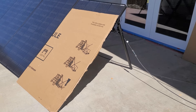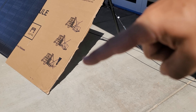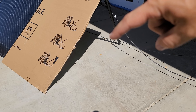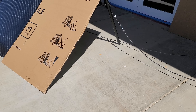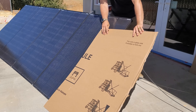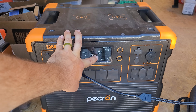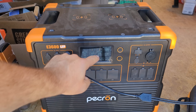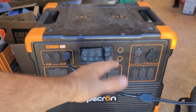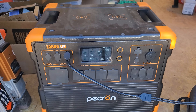It's important to keep in mind that these panels are not directly facing the sun. You can see the shadow line here — that is the angle at which they are not facing the sun. If they were perfectly perpendicular to the sun, this shadow would be directly behind the panel. So we're not going to see full solar output from these panels in these conditions. Now I'm going to cover just about one half of the solar panel. We're back up to 450 — it was just at 460 watts. So now it's basically three and a half panels worth of power compared to before, since we were a little over 500, and at 125 watts per panel on average, this is basically making three and a half panels worth. This is awesome.